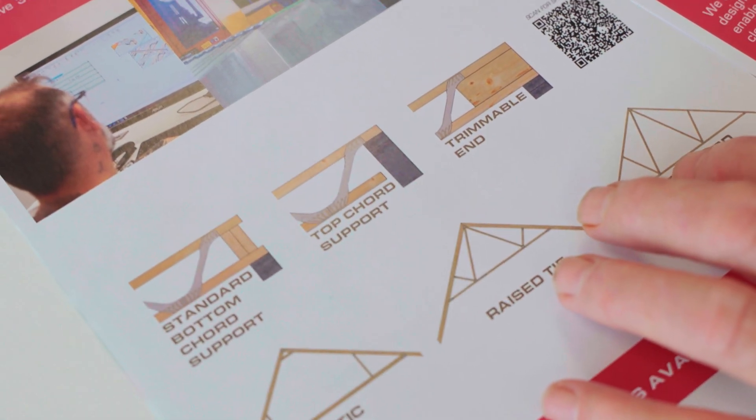Is that wind bracing or just to get them upright? Wind bracing is a separate engineered design item — it typically sits underneath your trusses and connects along a bank of trusses, fixing them to the wall. Stability bracing is what we use here, and that effectively fixes one truss to the next in a transverse direction so the truss can't buckle one way or the other. It's braced one truss to the next using generally standard 22×100 timbers.